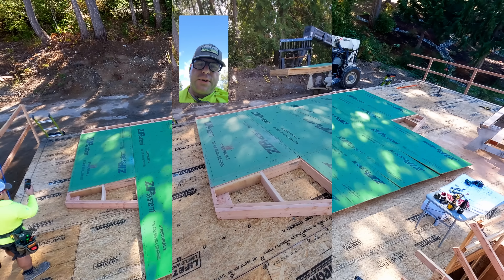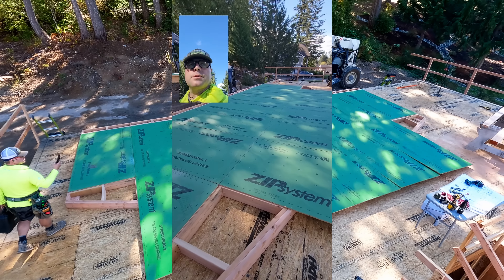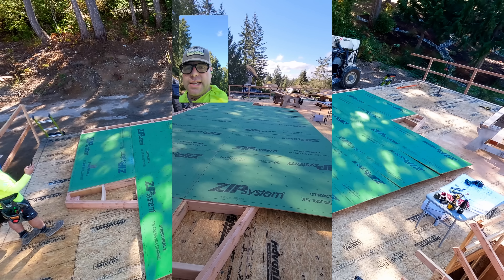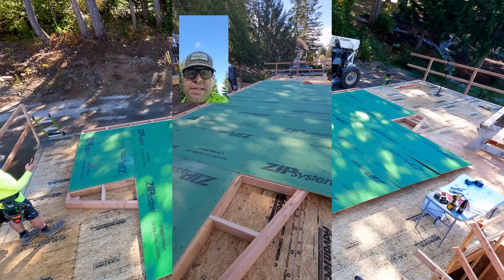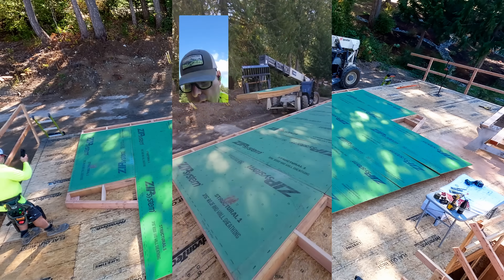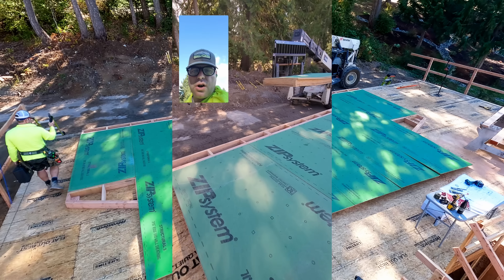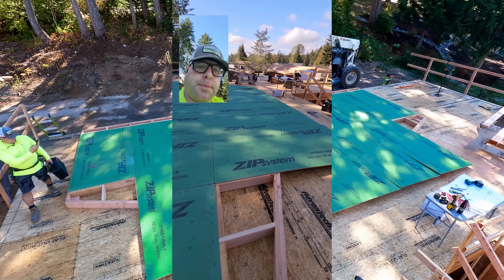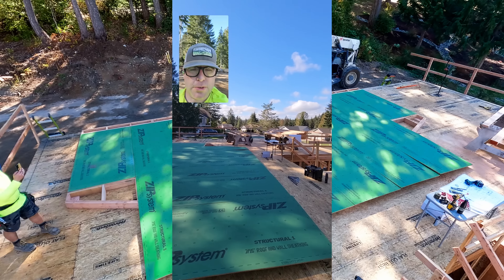I forgot to timestamp when we got done framing, but it doesn't matter. I'm going to route all this stuff off — Kyle's going to nail it. We have a 4x6 blocking on the seam right through there, flat blocking. This is actually going to connect all the way down to the mud sill, depending on which wall. This wall is actually going to go where I'm standing, not over here.